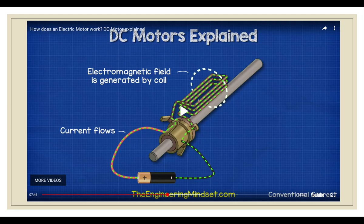You can clearly see here how the coils are basically being wired up to the commutators. In bigger motors where you have more commutators stacked against each other, you will have a different arrangement or different ways of attachment of a coil to a commutator, and therefore we'll define the current route a different way. What happens at the coil is that it creates an electromagnetic field around the coil as you put the current in.